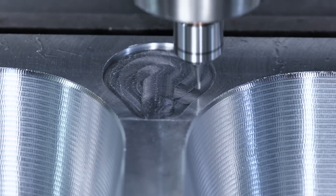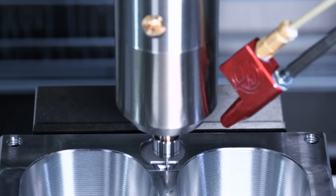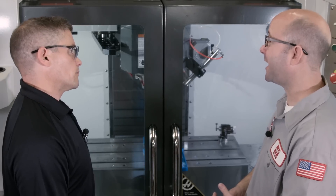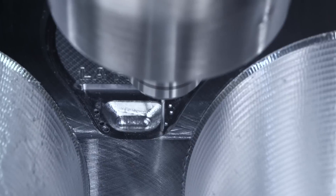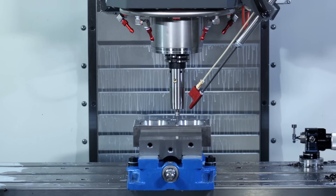It looks like you're starting off with a really small ball end mill there. Really small — the ball nose is only 30 thousandths of an inch diameter, and we're using it to put a nice crosshatch pattern on the top of our part, and a little bit later we'll be doing some 3D surfacing with that same tool. We're going as high as 65,000 RPM with those high-speed spindles — using that for engraving and micro drilling a little bit later on. These are very small tools that take very small chip loads, so the faster we can turn that spindle, the faster we can feed it and still maintain our perfect chip load. We also have the MQL option installed in this machine lubricating those tools — it's a good match and keeps our tools nice and sharp.